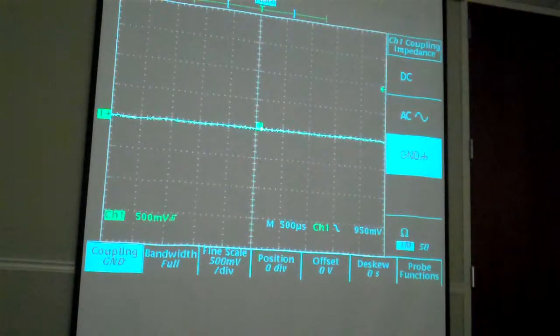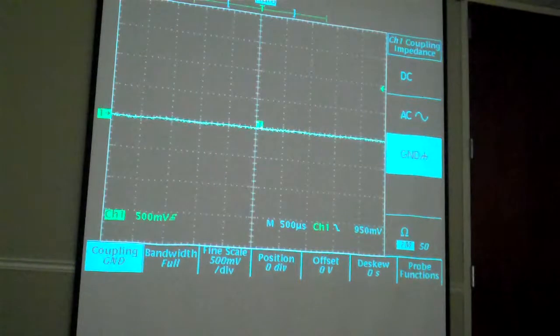So Clint, I was just wondering, the purpose of using the AC input coupling, would it be to look at ripples in your power line? Yeah, if you had 50 volts of DC and a 2 millivolt signal riding on top of it, you'd have to set it on a 50 volt scale to even see the thing, and then the 2 millivolts would be invisible. So it's essentially just to recenter the signal in the middle. You get rid of that 50 volts. It removes the fixed DC component.